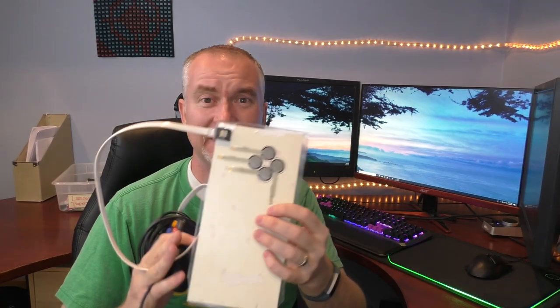We thought that pressure sensitivity, despite all the other challenges with getting spacing for the keys, seemed pretty bad. So we scrapped that completely. For the next Aimpad prototype we decided that infrared sensors was the best solution. We made a PCB with sensors mounted to the bottom and 3D printed keys that were very smooth and nice feeling — and it actually worked pretty well. We felt strongly this was the direction we needed to go.